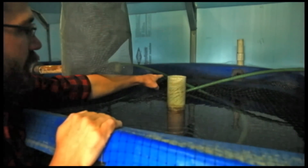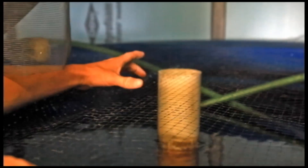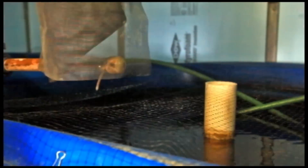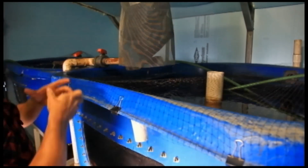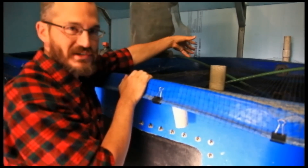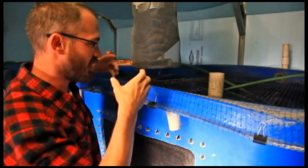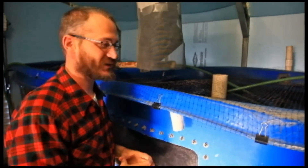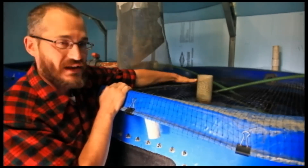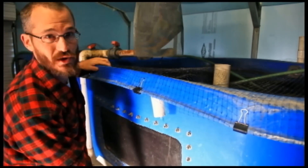This large pipe here is the outside pipe — that is a four inch outside pipe. It's open down at the very bottom, allowing the solids from this conical bottom tank to flow in and flow up the inside of this pipe. Inside of there — it's hard to take out — but if I took that off, what you would see is an opening at the bottom going into our clean-out system, and you would see the inside pipe standing basically in an L that goes into that two inch piping down there.